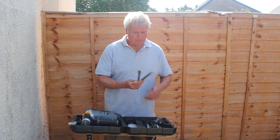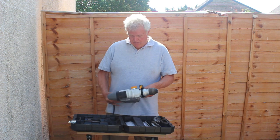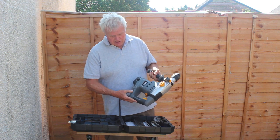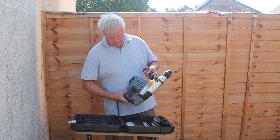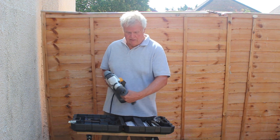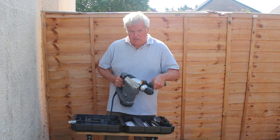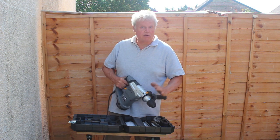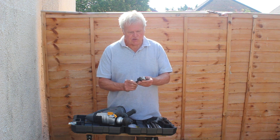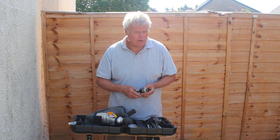I haven't used the point yet at all, but I've used the flat chisel a lot. It also comes with a depth gauge. It's a single speed but variable — there's a variable button and a turned screw that adjusts the speed from slow up to fast, which gives you quite a lot of flexibility. It comes with a handle on the front which is adjustable, and you need that. This is a powerful drill, and if it jams you need to be able to hold it hard to let the clutch work — it's got a safety clutch. It also comes with an M14 standard drill chuck and key, should you wish to use ordinary drills that you already own that are not SDS.